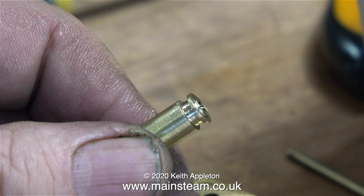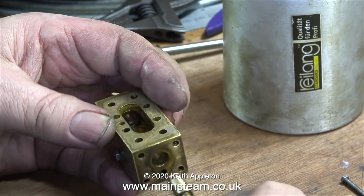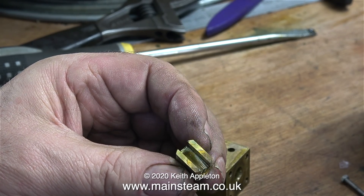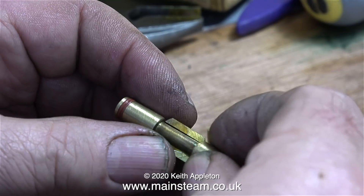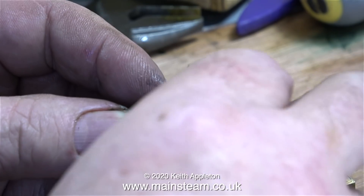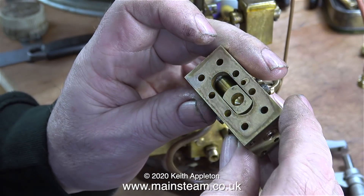I can't use this o-ring in the current shuttle piston because the groove is too wide and not deep enough. The clip on screen now is after I deepened the groove, because I had a thought that when the shuttle piston gets hot and expands it was pushing the o-rings out too tightly against the cylinder wall. With everything cold, the shuttle piston is now a better, slightly looser fit. I check the fit of the slide valve on the recess in the shuttle piston — it's okay but there's some evidence of burring. I'm using a small needle file to clean up the inside of the slide valve. It's very important that slide valves have a slack fit on the shafts — they need to float; it's the pressure of the steam that holds the slide valve against the port face. It probably would have been better if this slide valve had been machined from square bar rather than round bar, so the edges would have been square and less likely to get burred. As you can see, it's not a tight fit at all now, and if I turn the cylinder block over the valve falls out onto the bench.